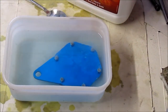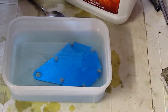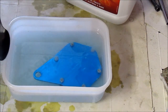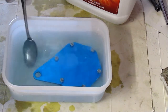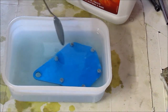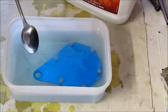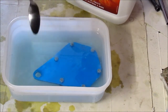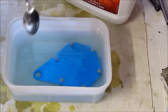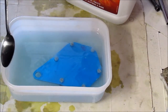After another minute, the solution is starting to turn a little blue as the dye is leached out of the piece. You can see this clear water is now turning a slight blue colour. You can also see little bubbles coming off the piece. That's because the reaction causes a lot of heat, and if you wait long enough and the piece is big enough, the water will actually start to get very hot, steam, and give off horrible vapours. It's something to be wary of.